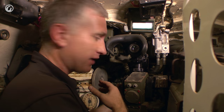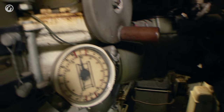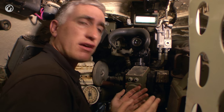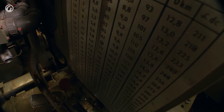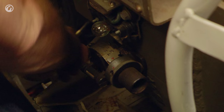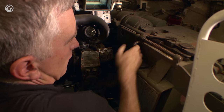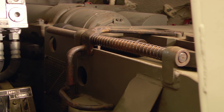To his left, by his legs, are some of the rounds of ammunition. The ammunition is scattered all over the hull. To his right, the D-10 100mm rifle — fantastic gun for its time. It has range charts for elevation marked on the side. This looks like the manual trigger — when your electricals don't work, just push down on this. I suspect this works in conjunction with a little system up here which, as you slide back, re-cocks the firing pin. So if you have a failure to fire, re-cock the manual and hopefully that will clear your problem.